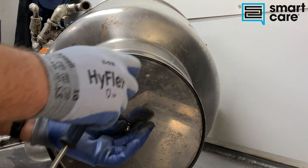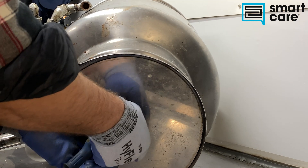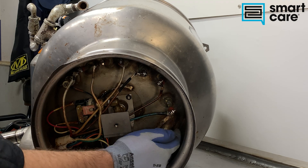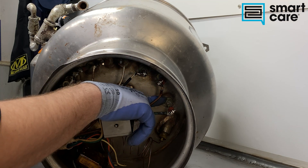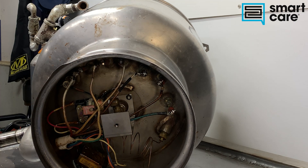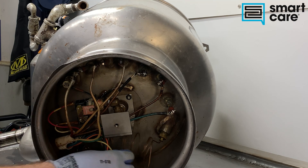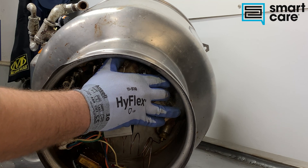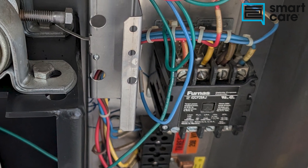This lowest portion of the kettle is not a part of the pressure vessel, even though it is welded together — it just has electrical components in it. When we look inside the lower part, you can see our thermostat. The thermostat feeds a capillary tube into the pressure vessel itself. All of our electric heating element connections are actually welded into the kettle. And then we've also got a pressure switch tied into the very bottom, wired through the heat circuit so it can interrupt the heat circuit just like the thermostat can. The contactor that controls power to the heating elements would have been mounted in the base of the equipment, connected to the heating element wires that come out through the tilt mechanism.